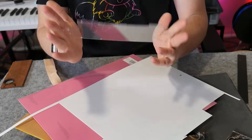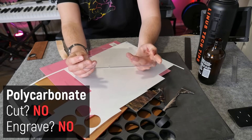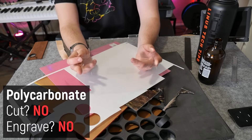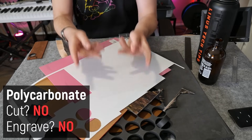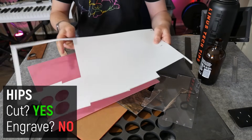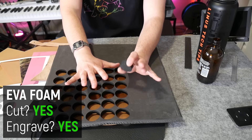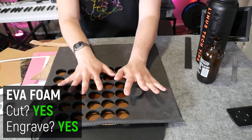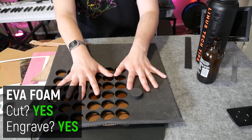You might be tempted to use a tougher plastic like polycarbonate, but although I've seen it cut in industrial settings, it laser cuts incredibly poorly — yellowed edge, charring, not very nice — and the fumes are probably not good for you. High-impact polystyrene laser cuts quite decently, a little bit melty, though I'm not sure if it's safe. EVA foam laser cuts really easily and etches, but it's another material where I'm not sure if it's dangerous — a lot of people online think it has chlorine in it, though I don't think it does. I use full extraction with filtering to mitigate any possible risk.